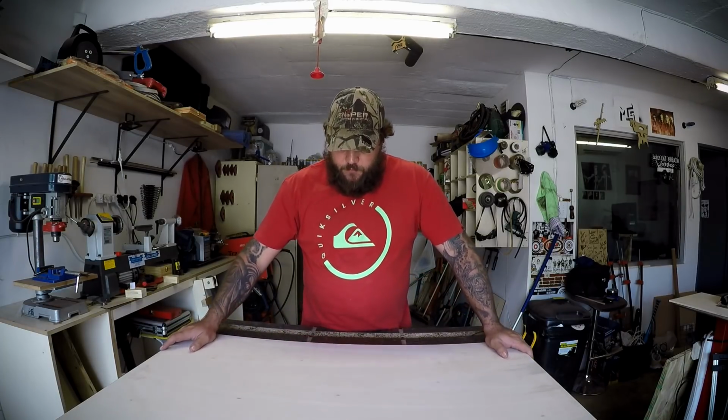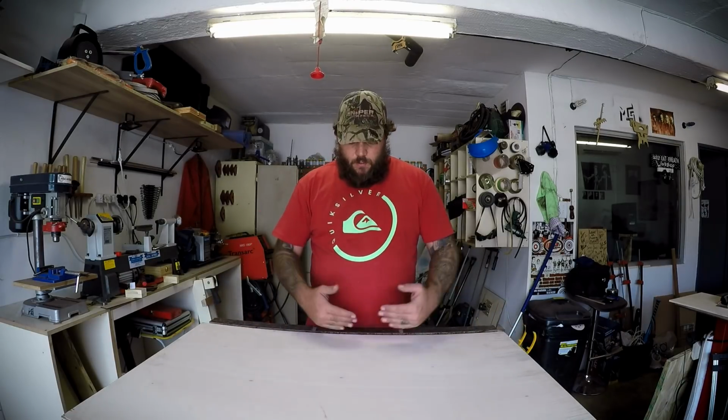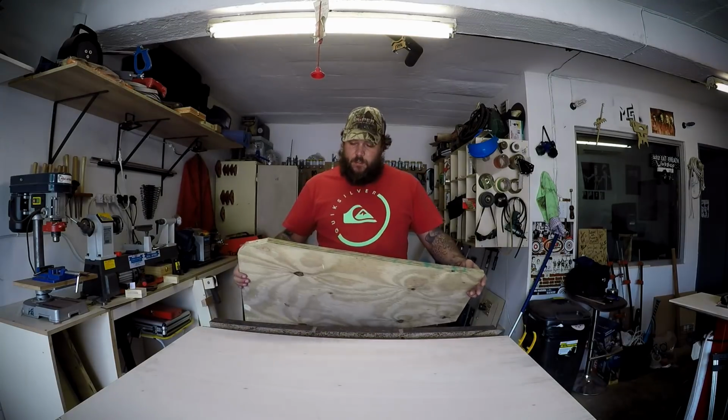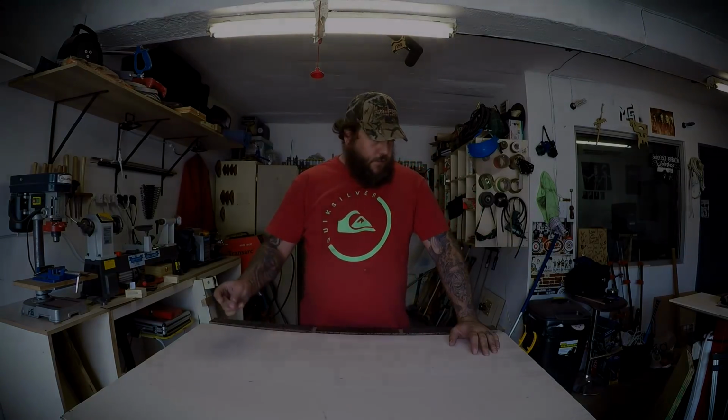I'm going to put the back one on first, and then I'll make a cut through here so that I can use the blade to square up the back rail, which is the one I'll be cutting against, so I want that one to be as square as possible. To make that, I'm going to use this 22mm shutter board, so let's do it.